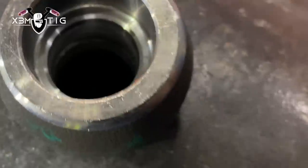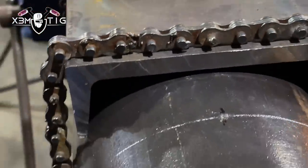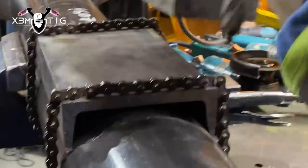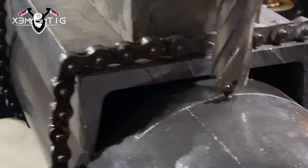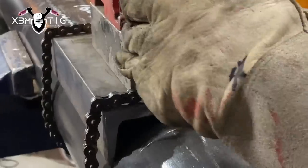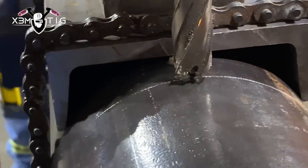This weldolet is a perfect example for a really tight spot. When you drill a hole, once you mark your drill point and put a center punch, a piece of channel iron works perfect — make it level, strap it around with chain grips, and set up your mag drill. The mag drill is the perfect tool to drill a hole on pipes. You definitely want to avoid drilling by hand with a cordless drill or whatever — it's going to bounce all over the place.